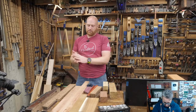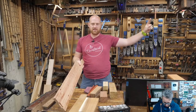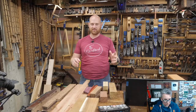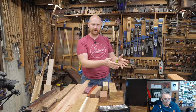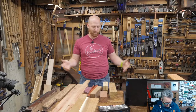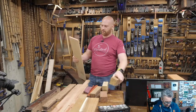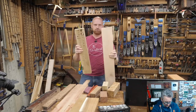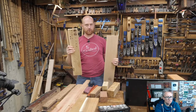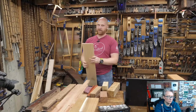It gets really confusing because there are a lot of gray areas in wood. You might say this is wood X, but the tree that grew ten feet away is the exact same species yet the wood inside looks completely different. A lot of times you think you want a particular wood and then you get to the lumber supply and it doesn't look like you expected. So a lot of times you just have to go in person, especially with oaks — white oak can look reddish, red oak can look white-ish, and the ring patterns can be very similar or wildly different.